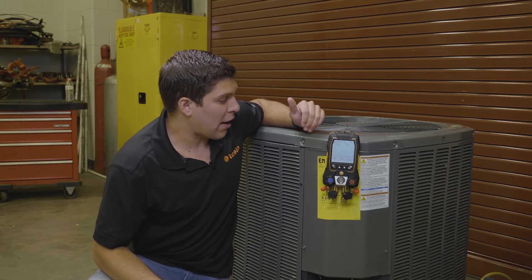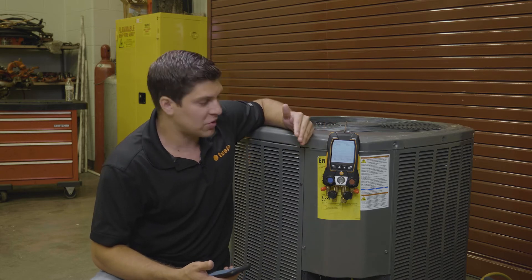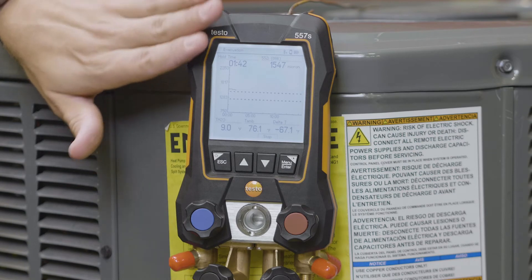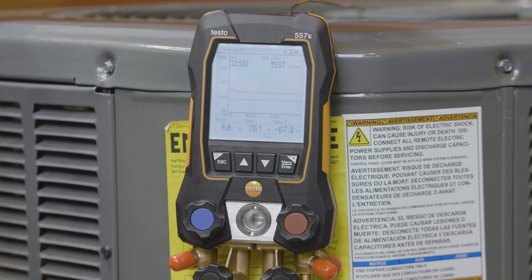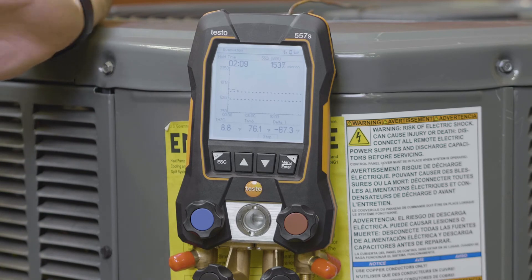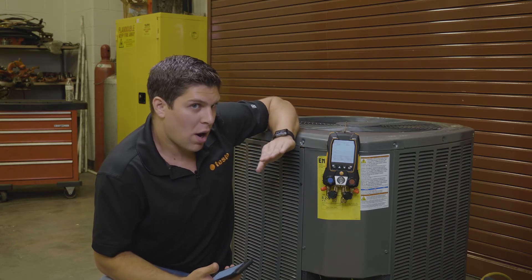We're getting closer to our maximum decay target. I did adjust it from the very beginning — we had it at 1,500, which is the factory setting that comes from Testo, but just for demonstration purposes I wanted to show how the graph is working and how the target lines are working. You've got the big display showing everything live — your temperatures and internals, your ambient temperature, and your delta temperatures. Your timer up here is very handy. The 552i is connected giving your micron readings live. I have it set to about 1,500 microns — you can see the little line is just about ready to touch 1,500. My actual evacuation target is set to about 1,250, so my goal is to hit about 1,250.